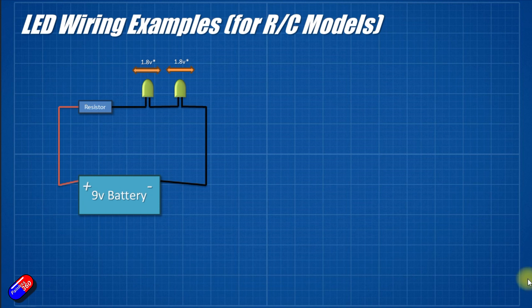Don't forget that each of these LEDs needs about 1.8V — that can be a little higher or a little less; some LEDs need about 2 or 2.1V, but typically a naked LED needs about 2V. We'll take it as 1.8V, which is normal for a 5mm LED package. So together these two LEDs are going to need about 3.6V. We also know we have a single lot of 20mA flowing through the circuit, which means if we take 9V and subtract 1.8V and another 1.8V, the resistor itself needs to drop 5.4V, because 5.4V + 1.8V + 1.8V = 9V. So we now know the voltage the resistor needs to drop and the current we want to flow.